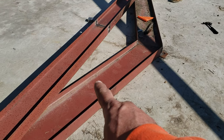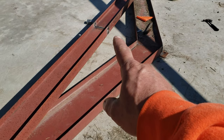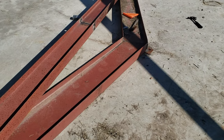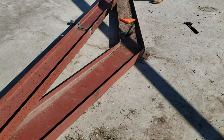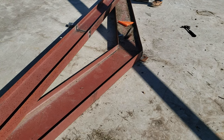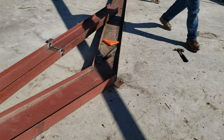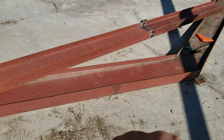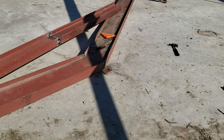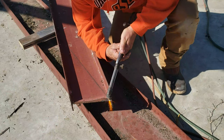But just for extra, and in case I want to lift something on that beam, to give it even more strength, I want to add this extra I-beam in the middle, and that will also give this I-beam tons more strength. It just creates way more strength exponentially. So that's what we're going to do right now. We get this slid on out here with Cap, get it marked. I'm going to blowtorch off the tips, get it welded up, and start welding our clips on for the C-purlin.